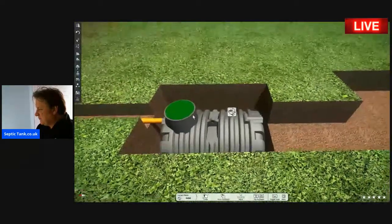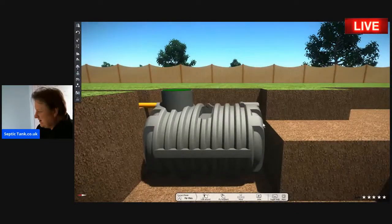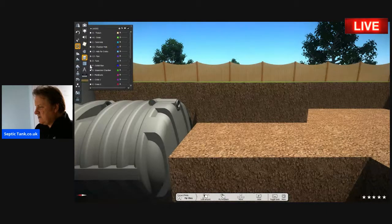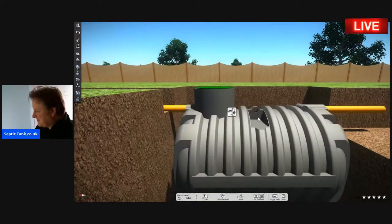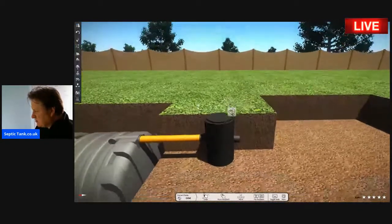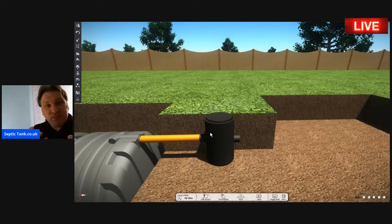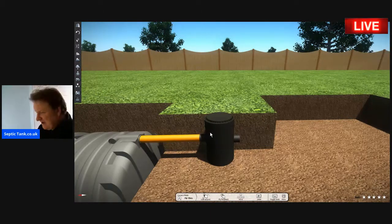So that's the tank in the hole. Now, you'll see on the tank there's an outlet, and on that outlet you have an outlet pipe — all your wastewater is going to come out at this point. So you've got your wastewater coming into the tank and your outlet pipe here. Then on that outlet pipe you put an inspection chamber — what I call a German inspection chamber. It traps all the debris such as sanitary towels, baby wipes, bits of hair, carrot, bits of food from the dishwasher, and believe it or not, it even traps nappies. They are really worth their weight in gold.